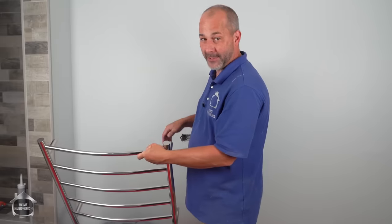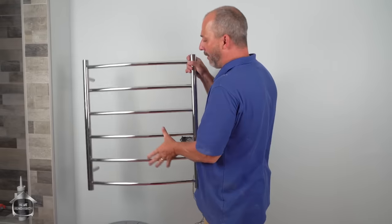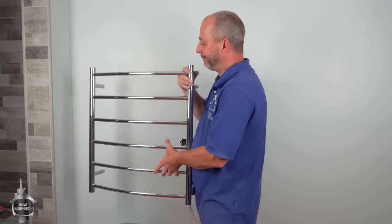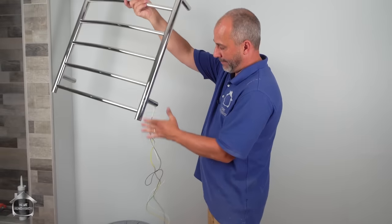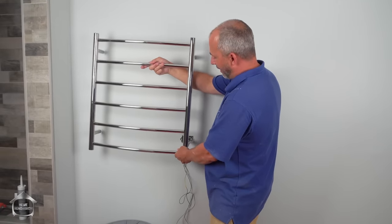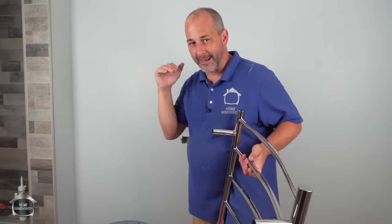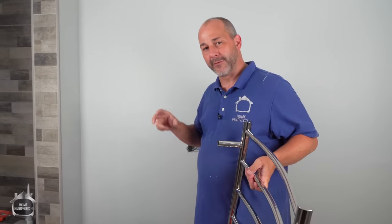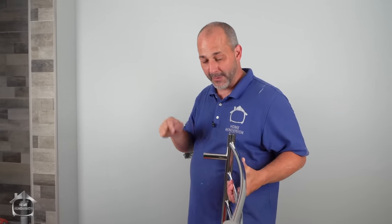Now, when it comes to location of your box, I find the easiest way to do it is figure out where on your wall you want this before you put your drywall up. And then make sure there's a stud on the one side, but on the power side, you want to make sure that you measure over to the center of your box, mount it on a bracing in between the studs, and it's good to go. Now, if you want to see that happen in depth, we have that information in our how to do electrical video for a bathroom. We'll put the link in the description below.